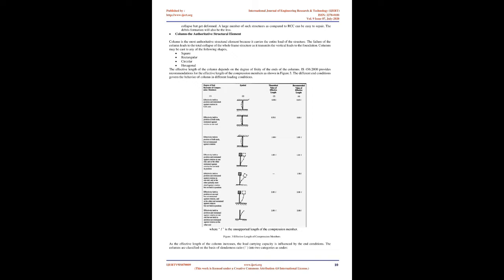The closer distribution and uniform dispersion of reinforcement transform the otherwise brittle mortar into a high-performance material distinct from reinforced concrete. Skeletal of the structure to be built is made first with bars or wires, which are used as spacer material, and the mesh layers are later attached to skeletal.